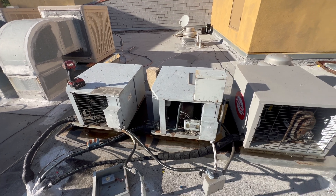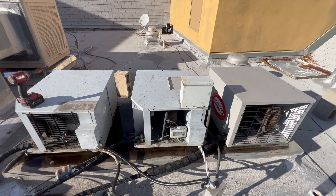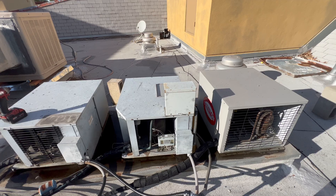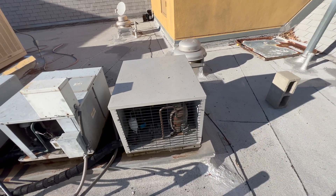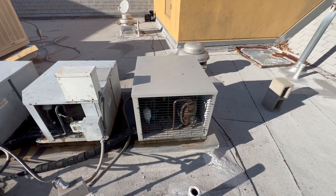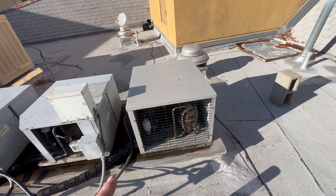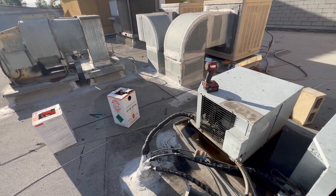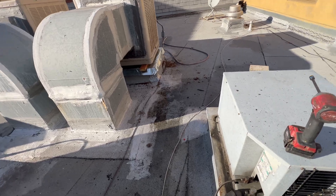Today we fixed the last repair for the freezer. This one didn't have much issues — fans didn't spin. Oh well, this is actually the walk-in cooler. Walk-in cooler, nothing was really wrong with it, didn't do much to it — just added a timer, that's pretty much it. Added a timer to this one too. This is our cook's line — it's a custom island, they couldn't remove it, it's kind of built in. A couple fans, added a timer to it. Walk-in freezer got a new timer as well, and a new pressure switch control — it was sticky. So a bunch of stuff.